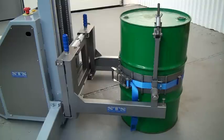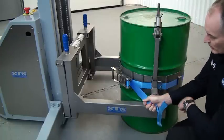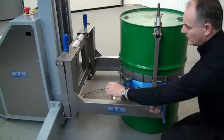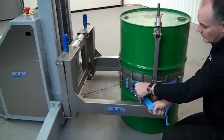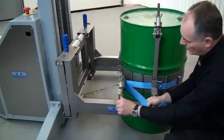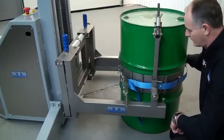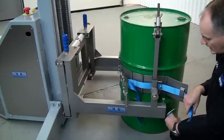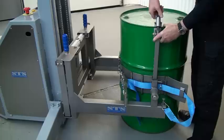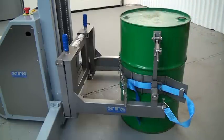When we want to disconnect after lifting and tipping the drum, we come down again, pick up the blue strap in our right hand, release the lever and bring it out, then take another bite and pull it all the way over so the ratchet is straight - this releases the strap. Push it away to get the slack needed to disconnect at the front of the drum, then put the pin on the front ring. Come to the rim clamp, hold it up, undo the nut, and disconnect. We're now ready to move the drum away.